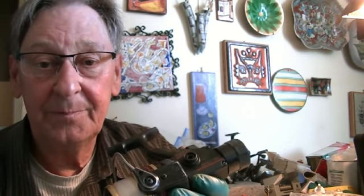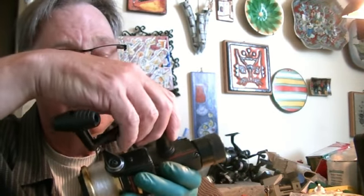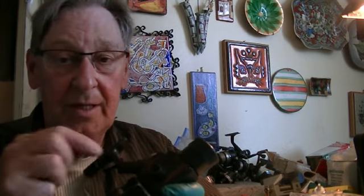So down in here, I'm going to make another bushing. I'll show you what I'm going to do. This is the main shaft, goes through, and right now it's a little loose. I'm going to take up any play inside this bushing with some epoxy. It worked on the other side, maybe it'll work on this side too. Be back in a second.